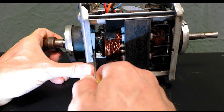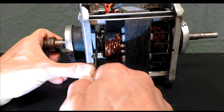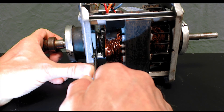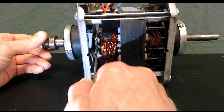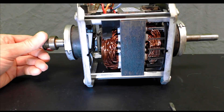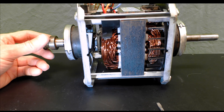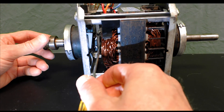And you can see the spring resisting that force. Once I do this, the contacts inside will be open and the starting windings will be out of the circuit. You can also see the couple of levers I was talking about before — the ones that will eventually switch the force over to the right and overcome that coil spring.